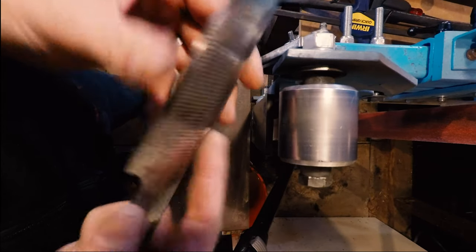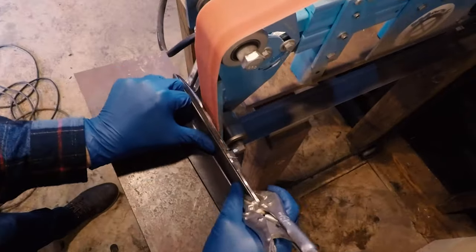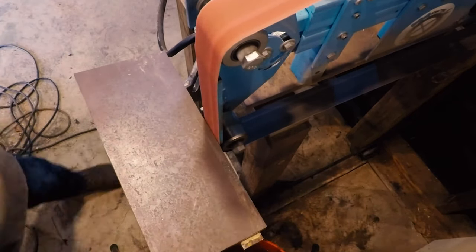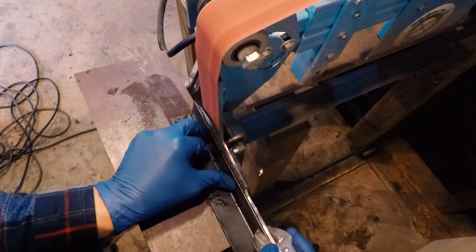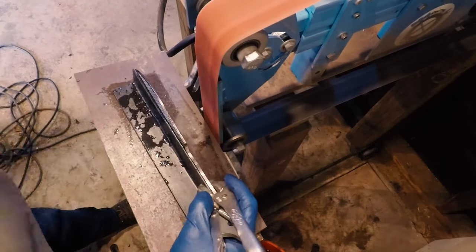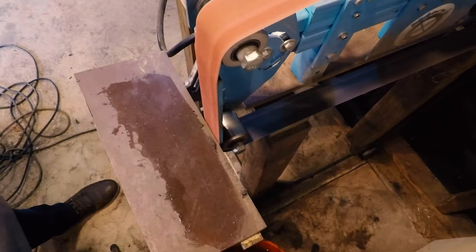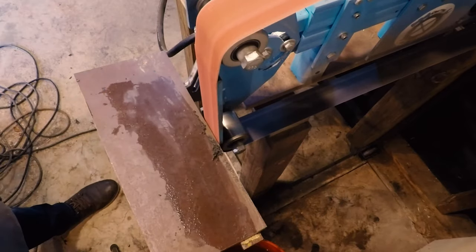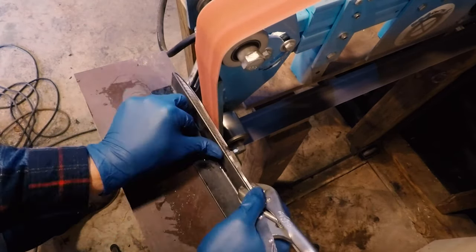The way I did that, I know a lot of you probably don't have a ton of money for a big granite block. A cheaper way to do that that works fairly well is to go to a local Home Depot store or a Habitat supply store, and you can get a 12 by 12 granite tile for like $1.50 or something really small that works great for giving you a flat surface without the cost of a huge granite block.